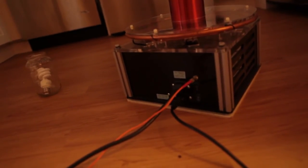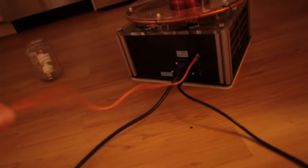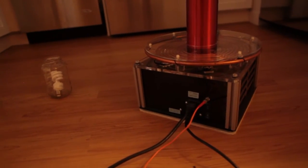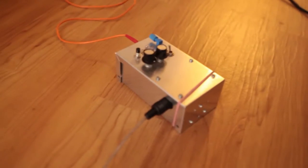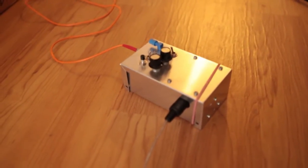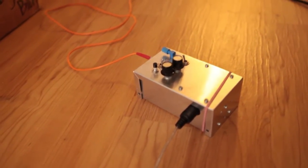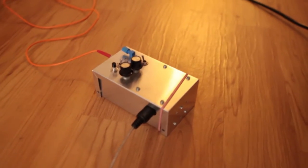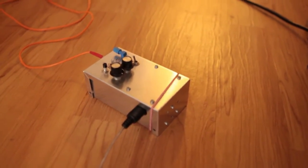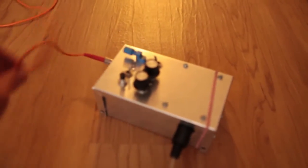In order for me to communicate with the Tesla Coil, you can see this orange cable over here. This is actually a fiber optic cable, and that goes to a microcontroller which talks to my computer. If we follow the fiber optic cable, we can see that it comes to a control box. I have a MIDI cable that connects to USB and talks to my computer. So I can play a MIDI song or use any sort of MIDI device like a keyboard, and send it to my control box, which has a microcontroller inside. That interprets the MIDI signals and converts it into a language that my coil can understand, and sends this via the orange fiber optic cable.